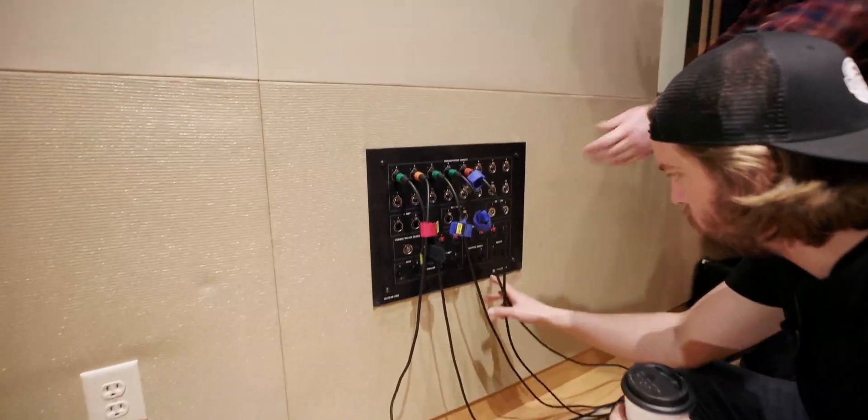This is a Jumpers panel — they do custom panels and they just did all the wiring for the entire studio. We have 16 mic lines here, a pair of return lines, our A-Net, and network for Dante stuff. We have speaker tie lines that go to the panels out in the live room and the control room, and then we have some MIDI stuff, word clock, and BNC for video. It's sort of a legacy thing, but we can tie into a patchbay back there with SDI lines.